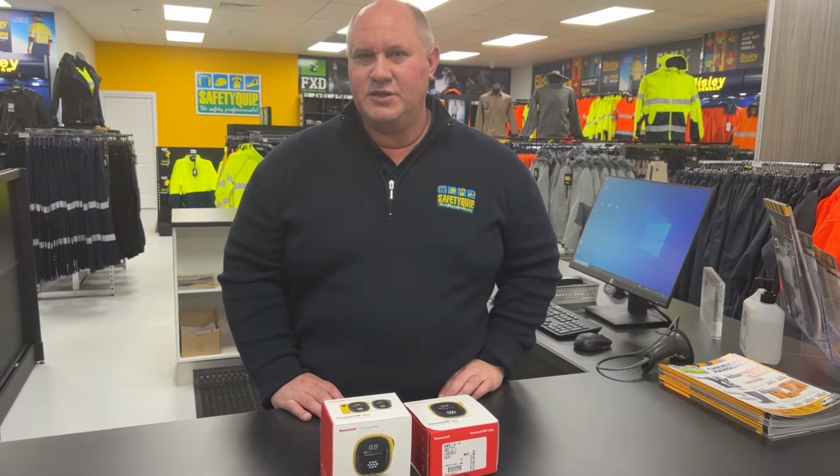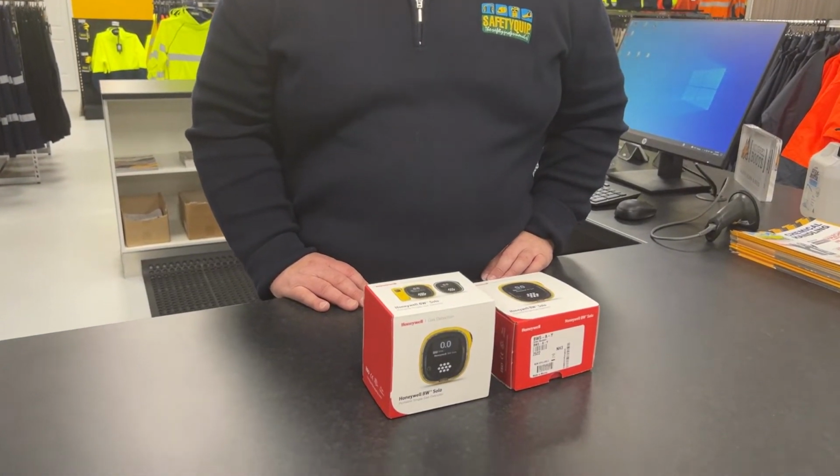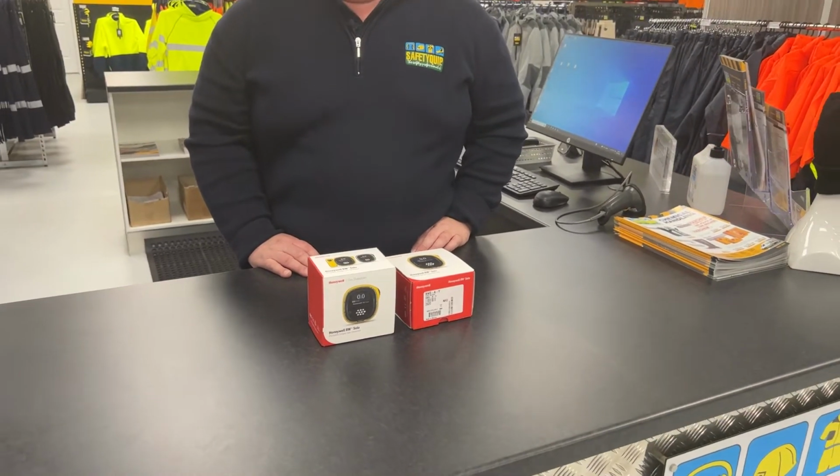The product is available in a pile of other sensor options as well, such as phosphine. That's a fumigant that is often used for maybe grain fumigation. It's used for carbon dioxide, carbon monoxide. Carbon monoxide is a byproduct of burning something, such as exhaust from an engine, a petrol engine or a diesel engine, maybe from burning gas. There's a whole pile of different carbon monoxide applications. Chlorine gas, such as around water treatment applications, maybe swimming pool applications, public pools. They're probably the most common ones. Hydrogen sulfide is another one. So that's rotten egg gas, rotting, decaying plants and animals.